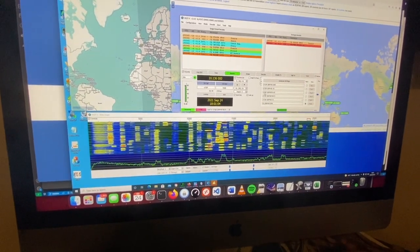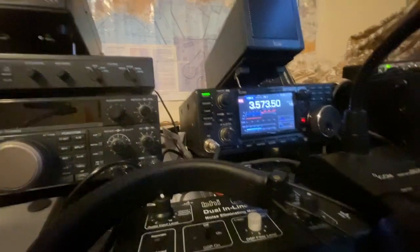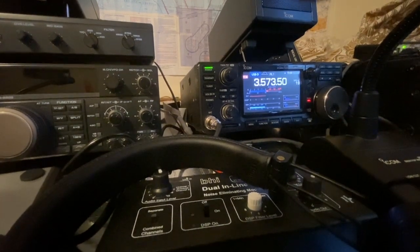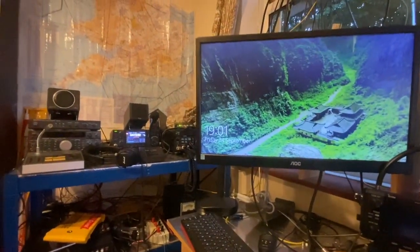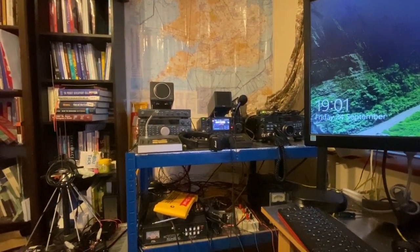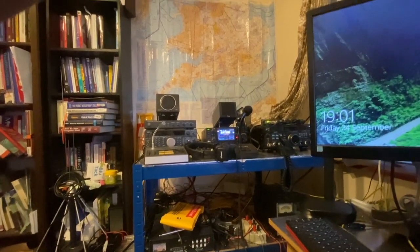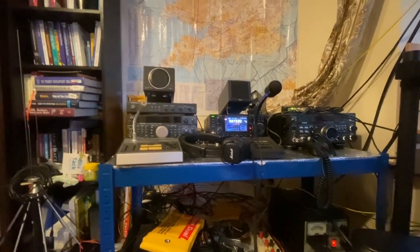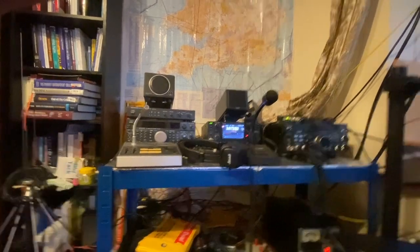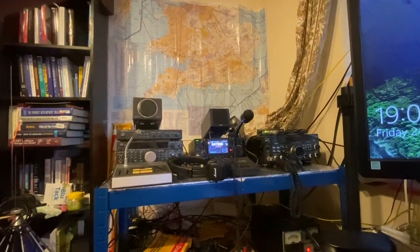Let's tune away - might need to adjust the ALC and the power here. Look at that - there's just no SWR at all. No ALC. Let's see if we can put the power up a little bit more until the ALC starts to complain. There we go - up and down. I'm sure people know this, but when you have an ALC that's like that in FT8, you're bleeding everywhere and it's not nice. You want the ALC to be one or two bars, tops. There we are - so we've got that dialled in.